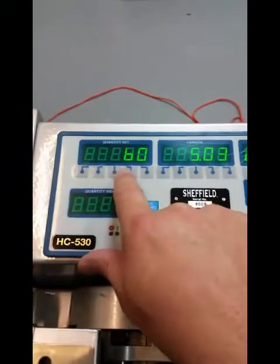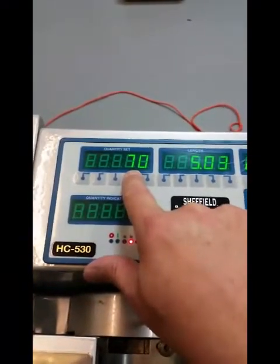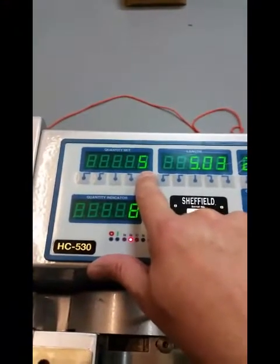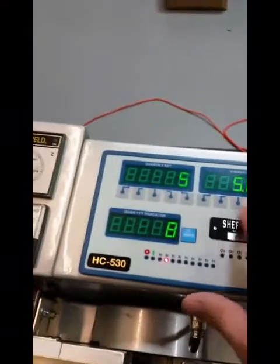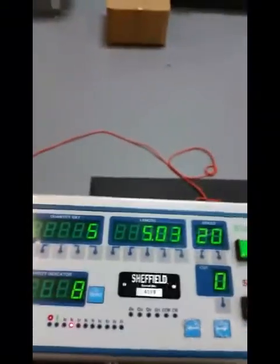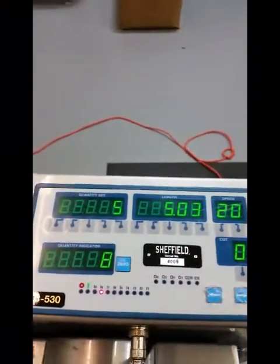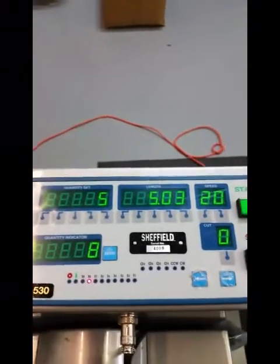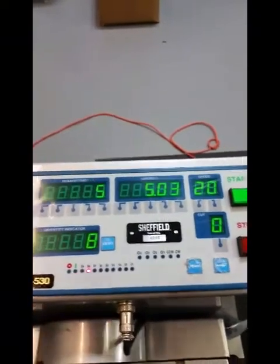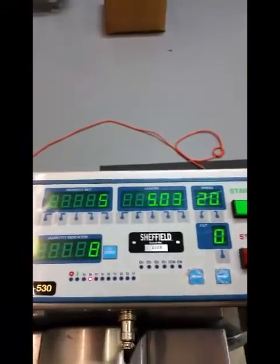In this case I'm going to do something very small, like just 5 pieces. We're going to cut that to 5 inches. You have an inch and a millimeter setting here. You also have a double-digit adjustment in case you have to modify the cut. 5 inches sometimes will be a plus minus of an eighth, 32nd of an inch, so you can adjust this fine adjustment to make sure that's right on the cut length you're looking for.